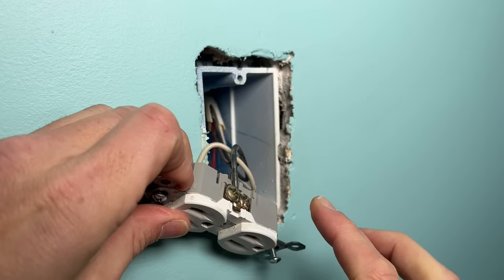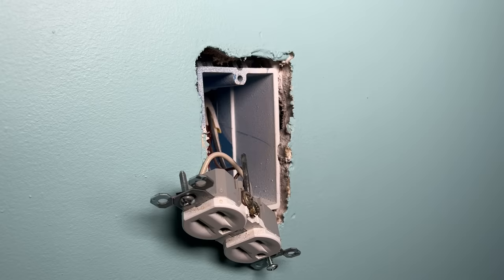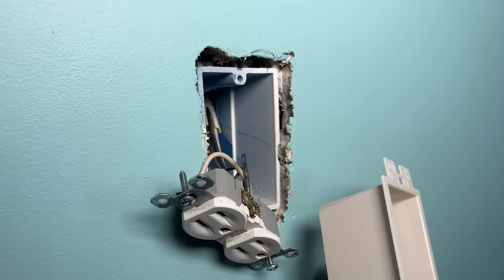With the insert, those terminals are encapsulated and you don't have non-combustible material — or in another case, if you have wood wall paneling, you cannot have any wood paneling exposed. I know this because I've done videos where I had wall paneling exposed and commenters called me out on it — and they were correct. It should not be exposed, and I should have used an insert to make it code compliant and safe.